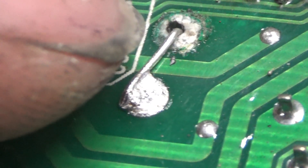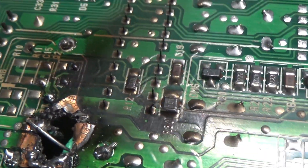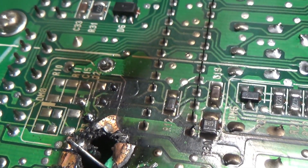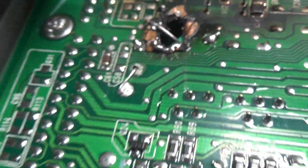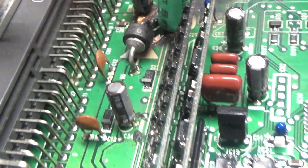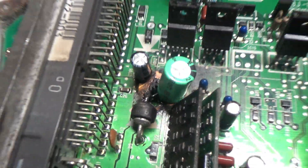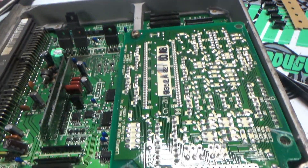It took the pad with it, so we went to the next closest source here and grabbed the circuit right there. With that being said, everything else has been looked at and looks to be in okay shape. When testing this ECU with the multimeter, we were reading 1600 resistance — now it's reading in the 500 range — so we are going to install this in the car and see what happens.